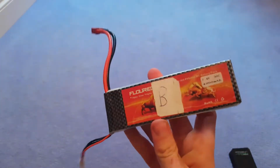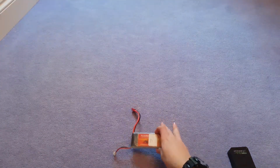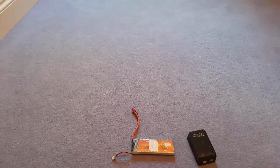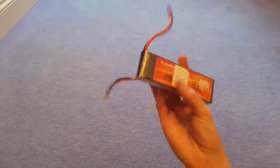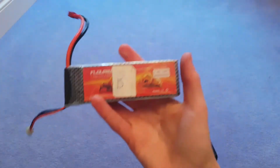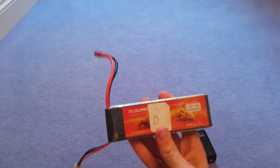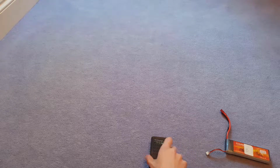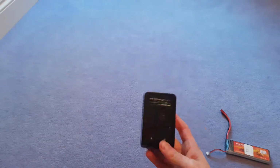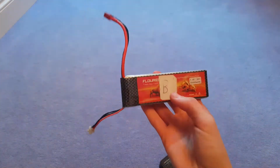Once I was building a project, and I took a drill, because I decided I needed to drill the holes in the top of the plastic, which I printed for an RC submarine, to get the ESC wires out, and accidentally drilled into a 1200 mAh lithium polymer cell, which then proceeded to fill up our garage with massive amounts of smoke and catch fire. Luckily, we managed to get it out and put it into a bucket full of water. So, if you use the wrong charger, you're going to end up with that in your house.